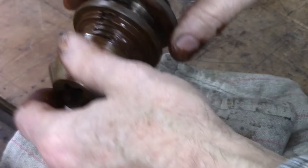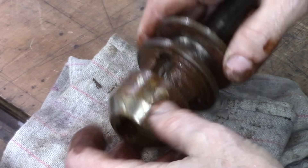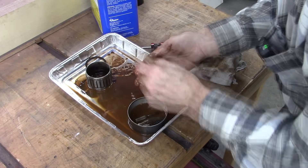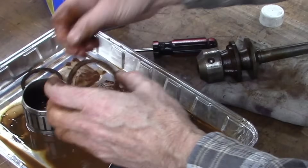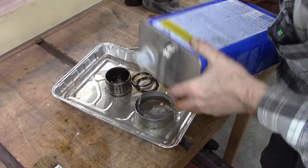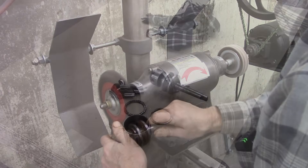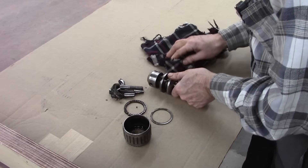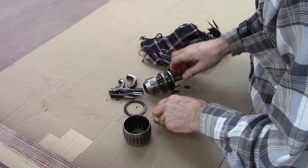The jaws come out just like that. That is amazingly dirty. I may have to buy a rebuild kit to make this one work right. That's supposed to be not broken right there. I've still got the ball that fell out right there, so maybe I can make it work. I'm going to rinse and repeat. I've got everything fairly clean here — lightly took some wire brush to it. I don't really like doing that to a machine surface, but it's better than the rust being in there. I've got a 20-weight oil coating the whole thing.